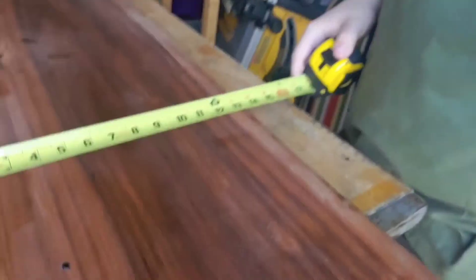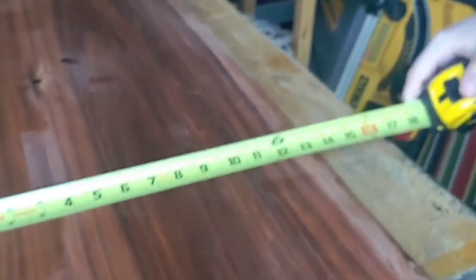Out here in the shop I filled a bunch of these holes with epoxy. I'm going to sand all of these holes because I'm not sure which side is going to be my top and which side is going to be the underside. I made these boxes at 11 and three quarter inches. At the shortest point I have like 13 and an eighth, so it'll be kind of close when I straight edge and cut it. I'm going to start with 60 grit and then work up to 140, then cut it and probably sand up to 220.